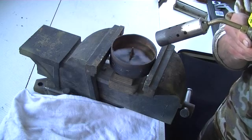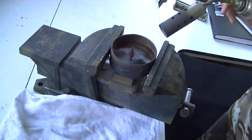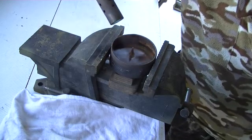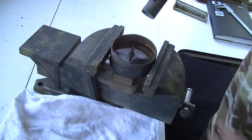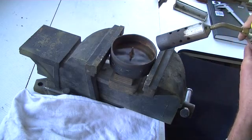You're looking for a colour change from brass colour through to blue — a brassy blue colour. So that's just about it for this projectile; it's pretty much ready to go. It would be easier for you guys to do this at night if you're not familiar with annealing and looking for colour.